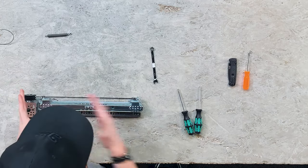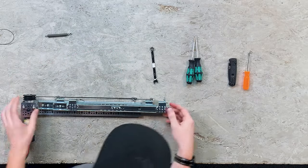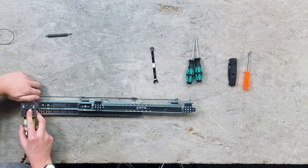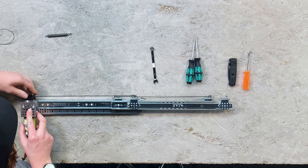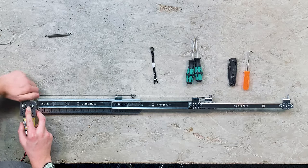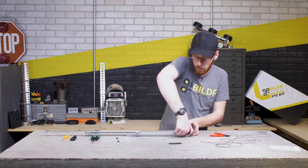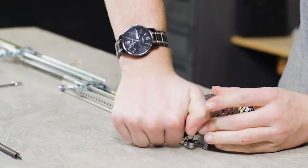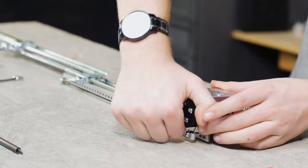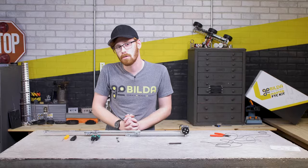What I'm going to do is feed out the slide by just rotating the pulley by hand. Pulling it out directly will just create a ton of tension, so we're going to simulate how it would work once fully rigged by extending it out by hand and hitting both end stops. We can get a little bit of tension in it — this will do a good job of pre-stretching our knots. If you're feeling daring, you could even run the motor a little bit to really give those knots a good workout before you set the tension for the slide system as a whole.